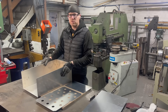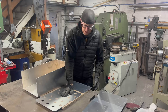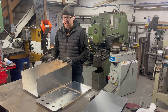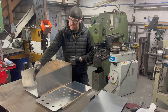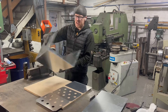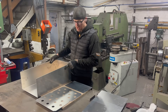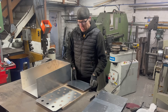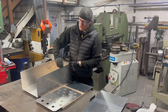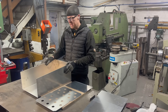Next up we're onto fuel tank fabrication. I've got some profiles laser cut and CNC folded, some baffles to go in the tank, the top sheet, and I've also got a near-enough duplicate of this tank. That's because the space available under the vehicle is quite limited with it being so short, so these tanks aren't massive. We obviously want a decent range for Bernard to reach all his destinations without stopping every five minutes for diesel. I'm going to do this one first — scotch up all the edges, clean up the aluminium, make sure there's no oxidisation, clean it down with acetone, then pop it all together and weld it up.